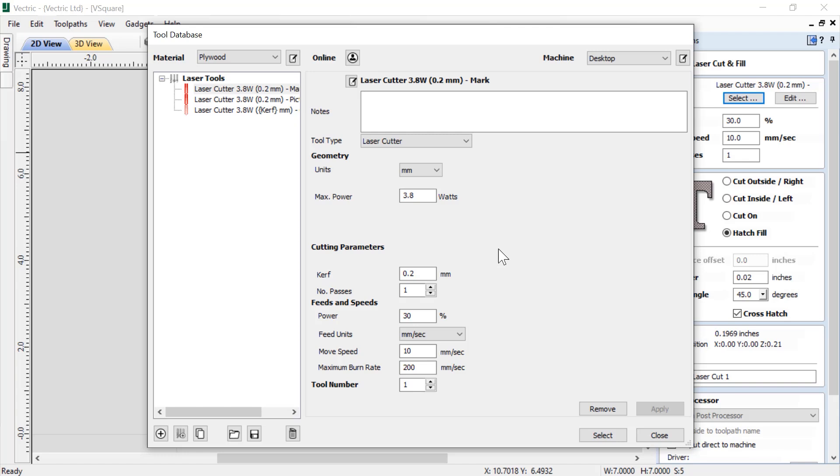The next set of settings is our cutting parameters. The first one is kerf — the width of material that is removed by your laser. This is dependent on the material you are engraving or cutting. For example, the kerf will be different when you're using the same power setting for paper as wood, since paper will burn faster. Also, the kerf will be different depending on the thickness of the material you want to cut all the way through. Many laser manufacturers will have the different kerf numbers for different materials as a starting point, but a bit of trial and error should get you the proper number.